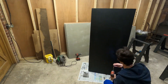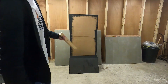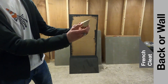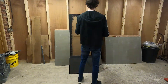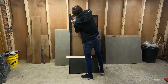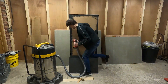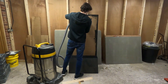With it upright, I finally get a bit of a sense of scale and how big the arcade is going to be. The French cleats basically form hooks — the French cleats on the back are going to be pointing upwards and the French cleats on the arcade itself are going to be pointing downwards. This means we can lift the arcade machine up and hook it over these hooks and it should hold itself in place on the back panel. You can see I already have the lines for where the French cleats are as I had already put the arcade machine on and measured this prior to recording. Now I'm just pre-drilling some holes and then attaching the French cleats in place.